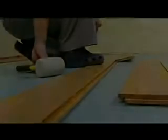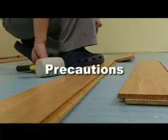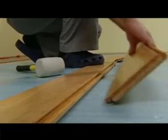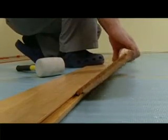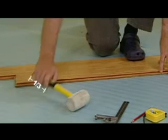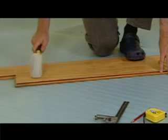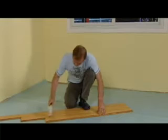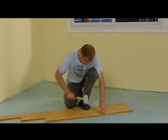are finished. Precautions. Whether in case of a direct away or converse installation, please always install as per the following principles. 1. During tapping, it is suggested to hold 1/3 area to the end of the mallet. Don't hold the front area. 2. Tapping always begins from the far side to the near side of your body.